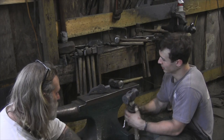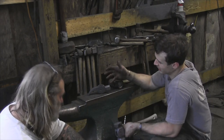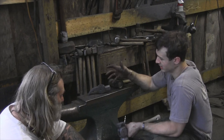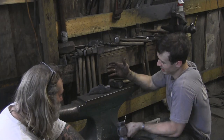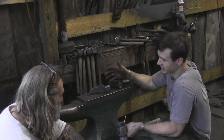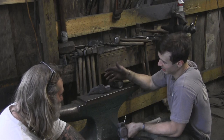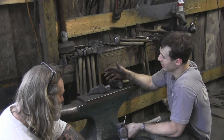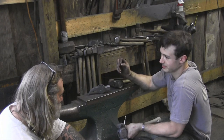And this one? This one I do in a heat treating oven. You can heat treat 4140 in a forge, but to get the most out of the steel, I use a heat treat oven. The process for 4140 is heating the steel up to 1570, soaking it for 8 minutes at that temperature, and then doing an agitated quench in Parks 50 quench oil. Then I temper them at 425 for two 2-hour cycles.